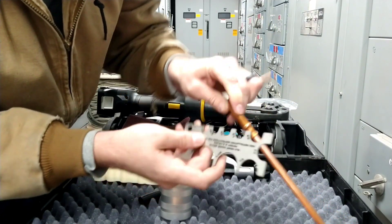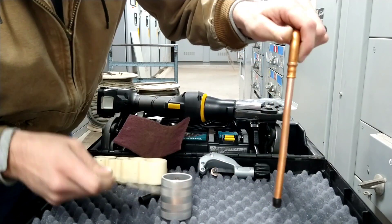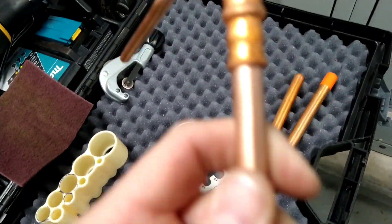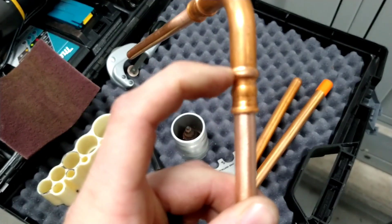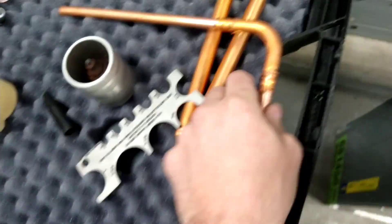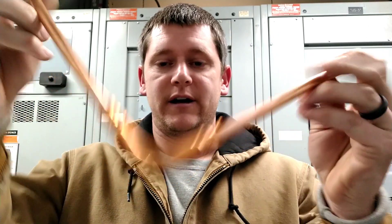Right there you have a fully crimped piece that won't leak — they say 15 years. I've been doing this for at least five years with this set and I've never had a leak. There's a fancy gauge that measures your crimp. Find three-eighths, put it on there, and it comes nice and tight — doesn't slide around. If you look close right where the crimp is, it says 'RLS' actually printed into it. That print means it was a nice tight crimp. You can see how quick that was — I didn't get torches out, nothing. Super fast.